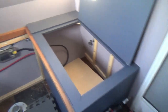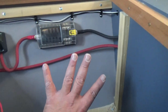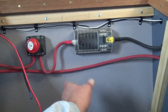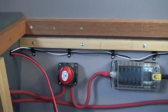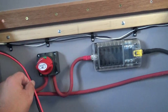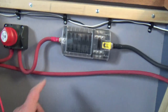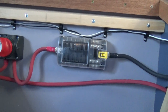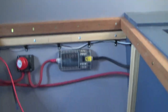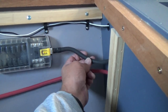Before the sun goes down, let me show you what I've got so far. I have my supports in for the false wall where the controller will mount. I think I'll have the solar shutoff switch on the outside, and on the inside I'll have a battery shutoff switch. When I connect to the battery it'll shut off power to everything, and I'll have a separate switch for the solar power only so I can still run off battery. From there I go into my DC terminal block — I've got all my positive sides here with room for twelve supplies of power, and the ground bus is on the other side.